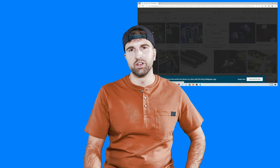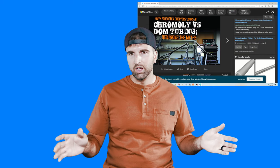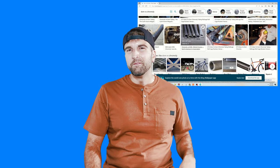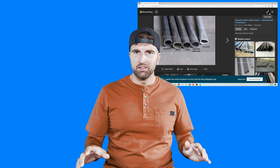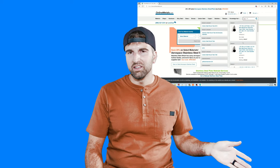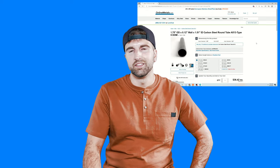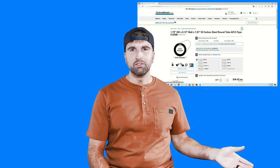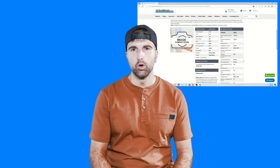The next is going to be the tube you're going to use. There are two primary kinds of steel tubing: chromoly or DOM tubing. Chromoly is top of the tier — premium, a little thinner, way more expensive. DOM tubing you can get from onlinemetals.com. I went with 1.75-inch 120-wall DOM tubing — that is a very beefy tube. It's going to handle everything you need, and if you were to get in an accident and have a total rollover, assuming you followed best practices for building a roll cage, that tubing is going to keep you alive.